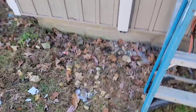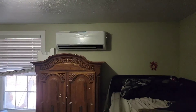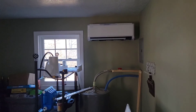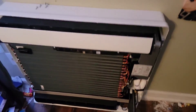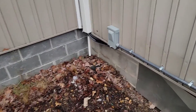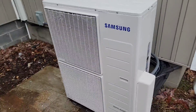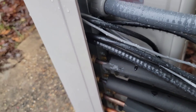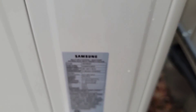There'll be more line hide cover. Another set of line sets going underneath the front porch — and those elbows look nice. This is the line hide cover that covers the line sets going to the console for upstairs, and there's another head. Looking good. There is the two ton head for the main living kitchen area. In the bedroom, this is the 7k. Another 7k wall mount for the laundry room. And this is the console for the upstairs bedroom. You can see where the line sets and the drain come out of the bottom corner there. This right here is the cover.